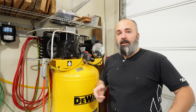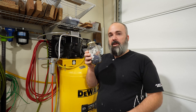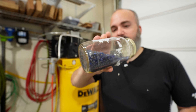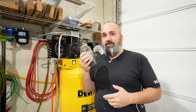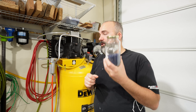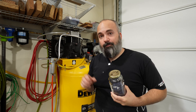I also tested out the theory of rechargeable silica. I threw it in an oven on a baking sheet at 250°F for about 15 minutes, and it turned back into nice bright purple. I did have some non-rechargeable silica mixed in that I'd been saving and it didn't fully recharge. I'm going to use the rechargeable stuff separately — as I save the silica out of my other two dryers, I'll put it in a new jar, and as it wears out, I'll dump it.